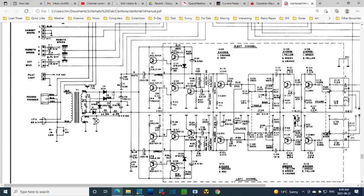Why is that? There's more current flowing here, and resistors, well, look at, even these are 2-watt resistors here. So even the amount of current, less current flowing in here, still demands big resistors here. These are low value, they're only 82 ohms, but they didn't even do it here. They could have done the same thing. They could have stuck 2 capacitors here, stick a little resistor in between. But the designers felt not needed. One big capacitor should do the trick.